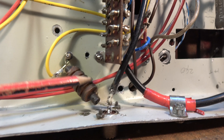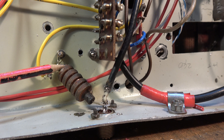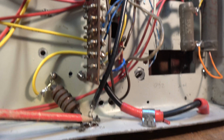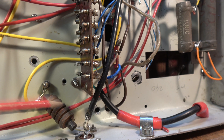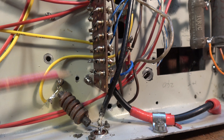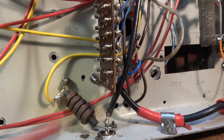An important thing: there's a choke straight across the antenna connector. The idea is if one of the coupling capacitors to the top of the valve goes short circuit, you'd get the full HT voltage on the antenna connector. With this choke, the antenna connector is effectively at DC earth, so it would just blow the fuses and turn off. But it's transparent to RF so it doesn't affect the RF signal — a little safety feature. And that's the bleeder resistor.